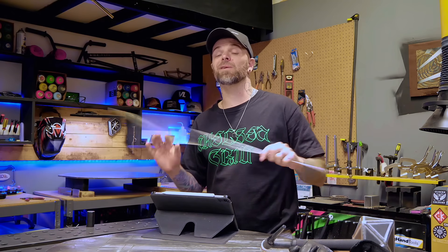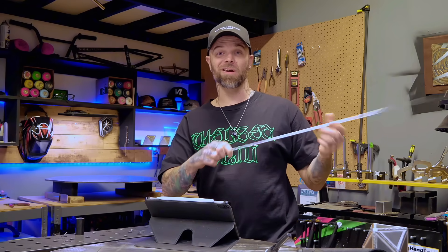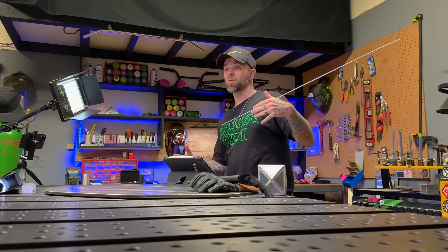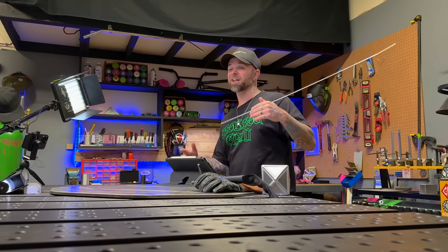This is very common for a lot of people when they first get going with TIG welding — don't sweat it. The overall awkwardness of knowing how to hold the rod and how to comfortably feed it is definitely tricky to learn at first. And as you start to get uncomfortable with your feeding hand and fumble with it, it can actually make things with your torch hand start to get shaky as well.